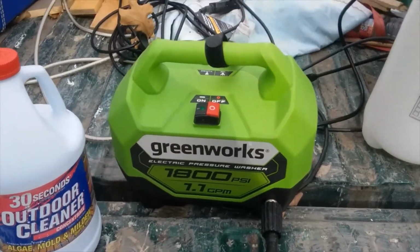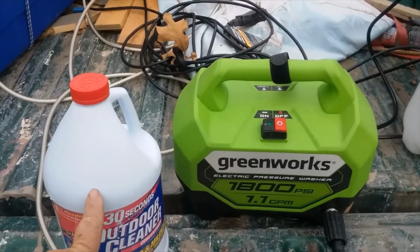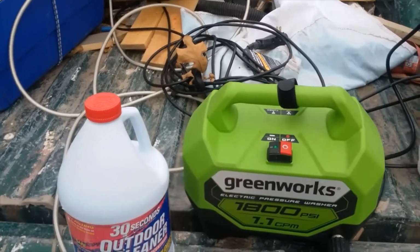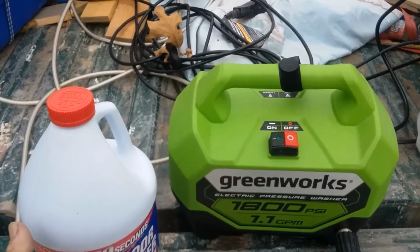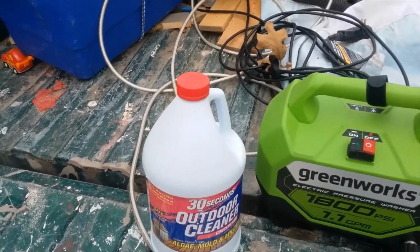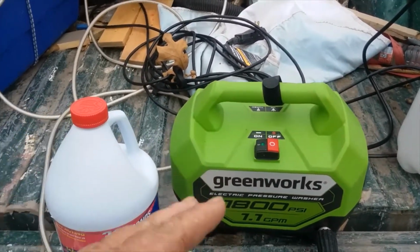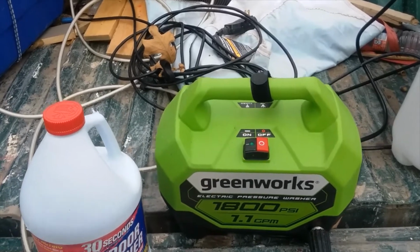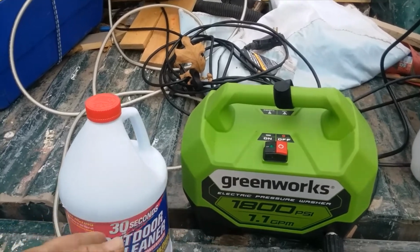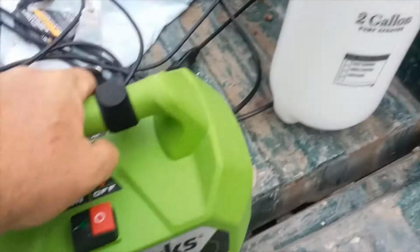So as you can see in the video, I cleaned some with the pre-spraying with the cleaner and some without pre-spraying the cleaner. Pre-spraying the area with this greatly helped it come off a lot easier. And when I was done, I'd clean the algae and the mildew off, and sometimes there'd be a mildew stain left, and I would go back and just spray this over, let it set another 10 minutes, and just rinse it off with a pressure washer. You'll see all that in the video. So that's all you need to get started.